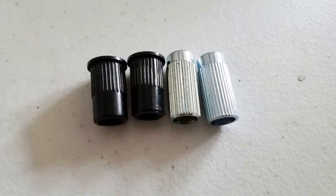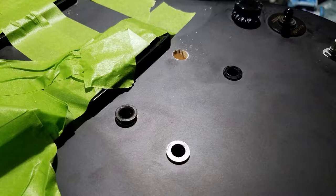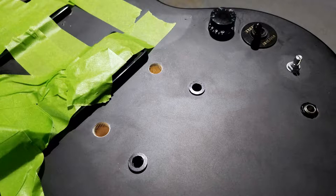We've run into a little snag. We're going from metric to standard hardware — metric black to gold. We had a converter set from Philadelphia Luthier for our American Tone Pros bridge, which is already installed. But on the stop bar, we don't have a converter or the proper posts for those bushings, which are still in black metric form. So we're going to pull those bushings out. I'll show you a really great trick I learned from YouTube using a piece of PVC pipe and a matching metric bolt that's way longer than the actual posts.